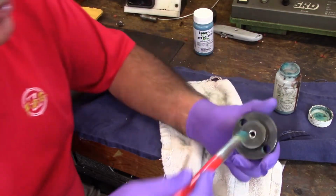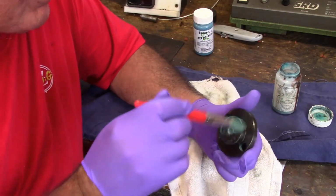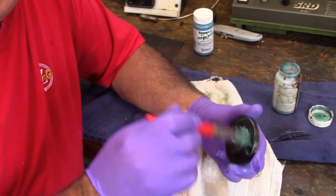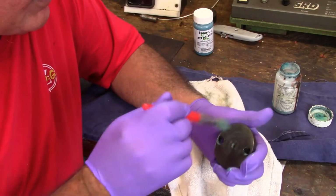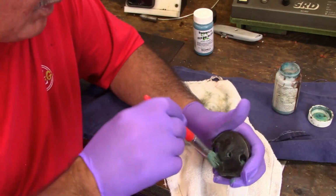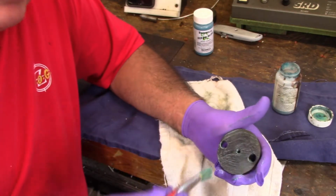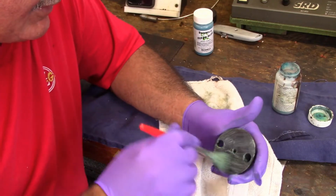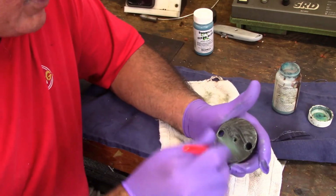And you see, I didn't show taking the stud out of it on camera. It was green Loctite in there, obviously, and I had to heat it. It took several attempts. I tried to machine it off, I was going to bore it and drill it, but the stud was too hard. I must have had a harder piece of steel. It did not want to machine well for me.